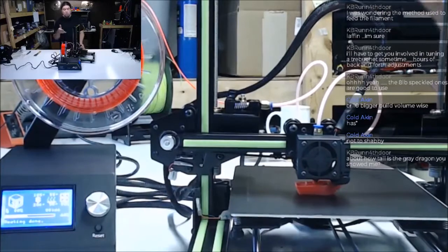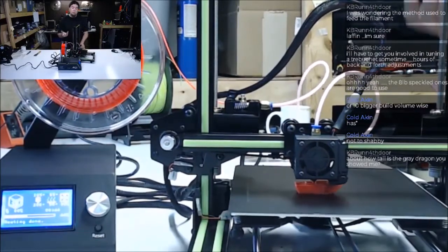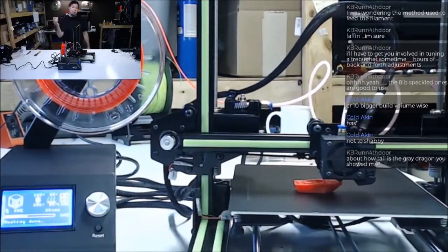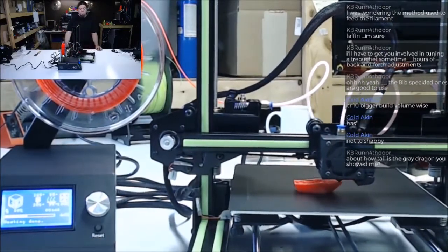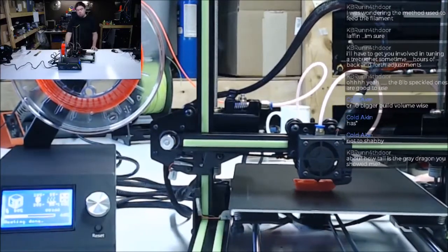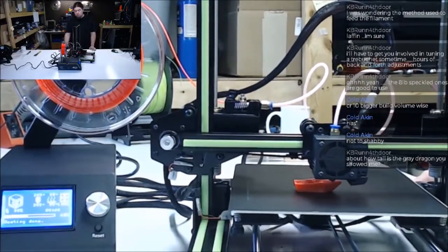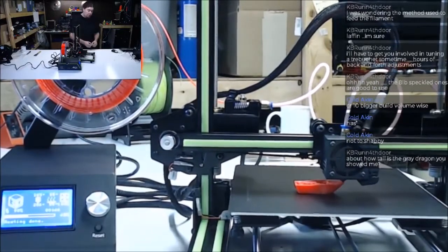So when you alter the temperature, when it falls, it'll start pulsing maybe too much or not enough, and it takes a big swing down before it can swing back up, or it takes a real big swing up before it can swing back down. So that's controlled by this PID tuning. So who knows how this one's been tuned, because they're not going to give you the firmware to look at it. But there might be some screens in there where we can auto-tune it and figure it out. Or just turn it off.